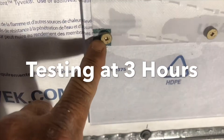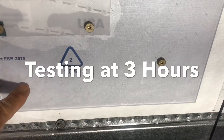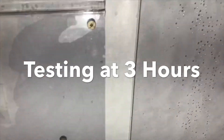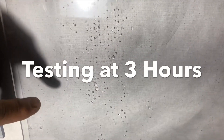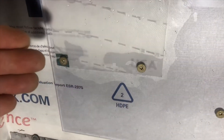Down there — that's actually soaked through the paper. The actual Tyvek house wrap is still soaked. This is why you need a rain screen. And then you see the FM3? Pretty much just a couple drops on the paper. That'll dry off real quick because you get the airflow coming through there. With this, you can't get any airflow.